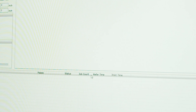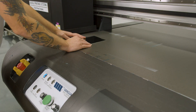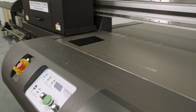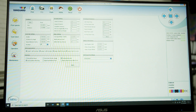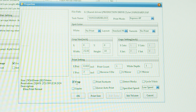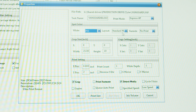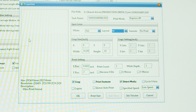In addition to the nozzle test, it is important to print a solid block of white to maintain proper head efficacy. This and your test print ensures Vanguard's continued support — it is best to keep a record of these prints for the next two months. I have prepared a large white block file ahead of time, so I'm going to select crop, detect media, and in spot color: white, fill, layout, W for white, and leave varnish as no print.